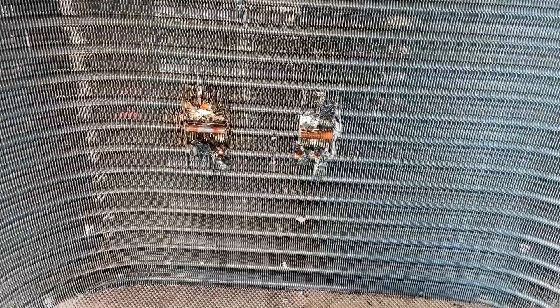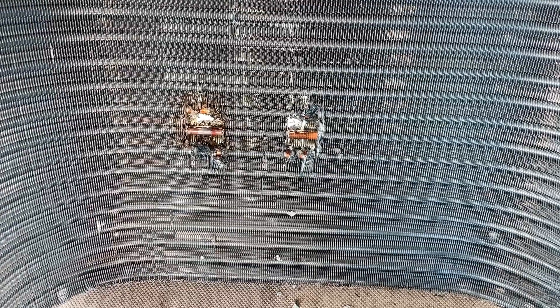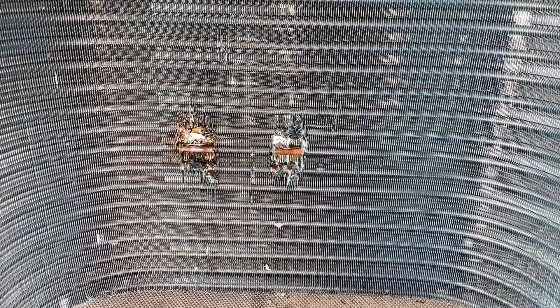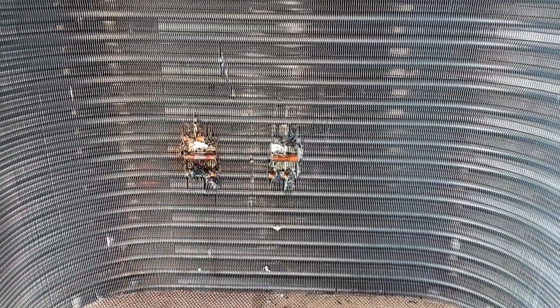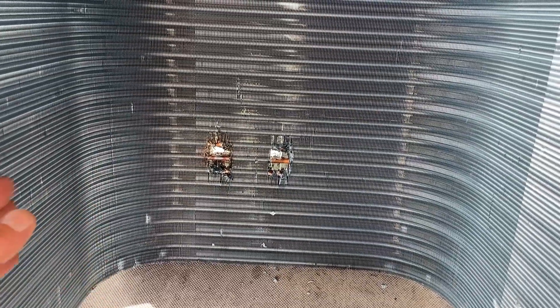There's the second crack right there. So what's the story here? This one seems to be really small — these were hard to find. No oil, and we only really found it as the system was running for whatever reason. Very weird, but cracks are like that sometimes. Sometimes they don't quite open up until you start jostling the copper pipe. But as the coil just sits in the unit and has not been disturbed, sometimes they will hold pressure quite well until they're either hot or cold or something like that. I'm probably going to recommend that this coil be replaced because we have two compromised areas in this little stretch — probably just shitty quality control.